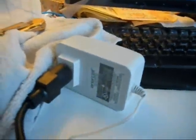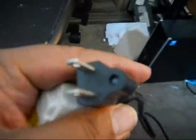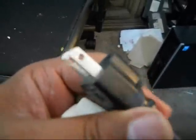Okay, I connected all the wires to the Sonoff, and I closed the case, put the screws in. That's what it looks like. So I plugged it in. I tore the ground knob, the prong, off since we're not going to be using it, so it'll fit on the extension cord. It doesn't matter.